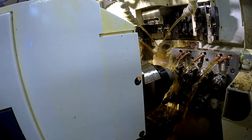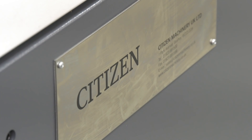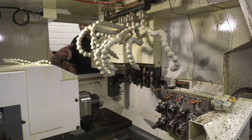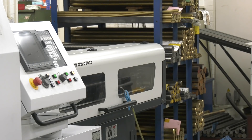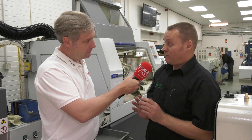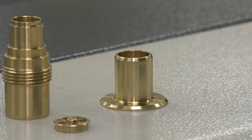You've got to invest to keep ahead of the competition. You mentioned spares and service support — how's that been? Not many issues with the machine, and the only issues we have had have been sorted very promptly. We talked about bar feeding — are there any issues holding tolerances and accuracy running 24-7? Not at all. Right from the start, with this part here, it's got a tight tolerance bore, and from switching the machine on to it finishing, we'd never even have to alter it. We have no thermal growth at all on here.